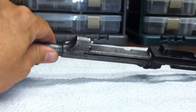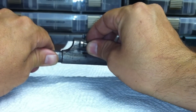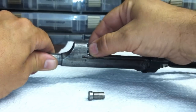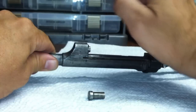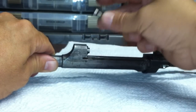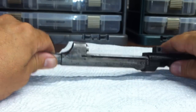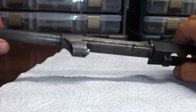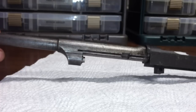You won't really be able to feel that slack unless you have both fingers on it, and the best time to feel it is when the nut is out. Different piston nuts will have a different amount of slack — they are a little bit different. But if everything's clean and good, get it inspected and your rifle should function fine. That's how you remove and install the gas piston on the M1 Carbine.